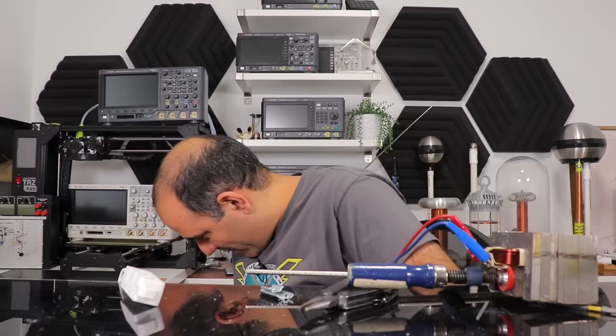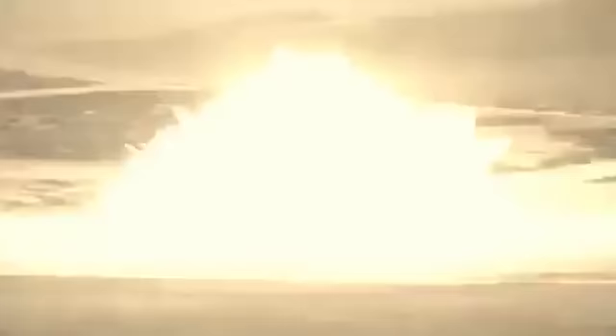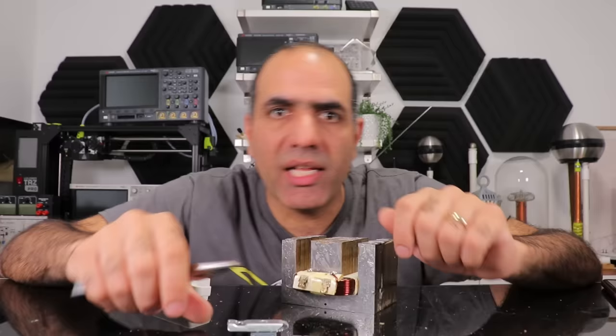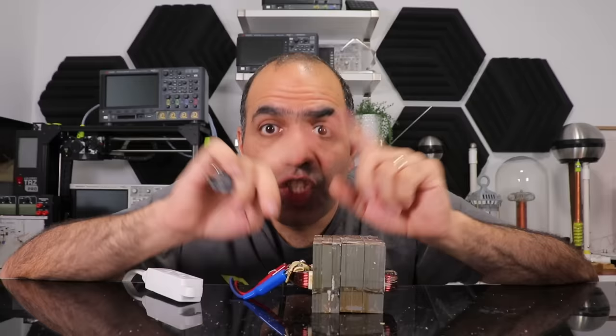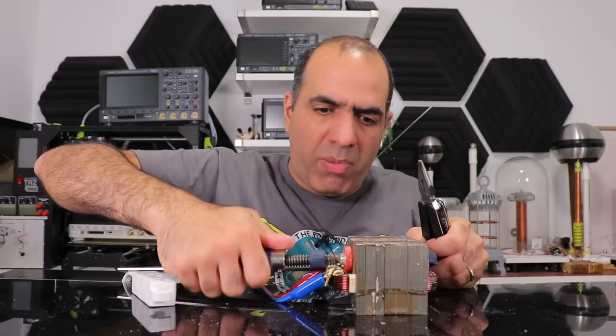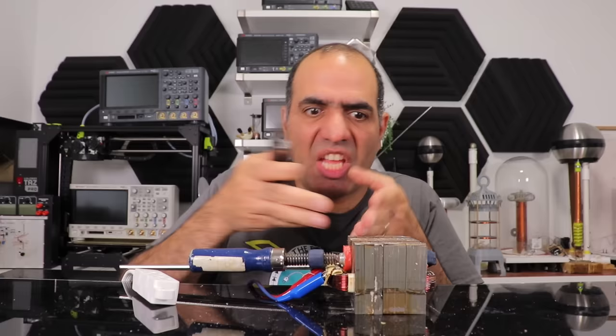My breaker popped. See? If your magnet is strong enough, it can literally pull metal out of the ground. Again, not something you want searching for landmines. We don't need that much strength, but we need to know how a piece of metal affects the magnetic fields and the inductor itself. We have to use AC to create changing magnetic fields. Changing magnetic fields create eddy currents in metal, which I talked about in my old video — which would want to push them apart, like you saw in the core. But in ferromagnetic material, like iron, the metal itself becomes an even stronger magnet with fields in the same direction as the electromagnet, and gets attracted to the electromagnet.